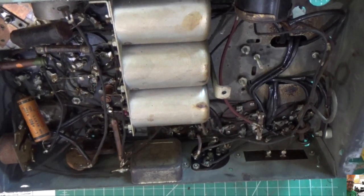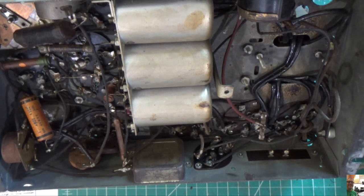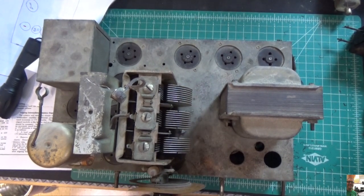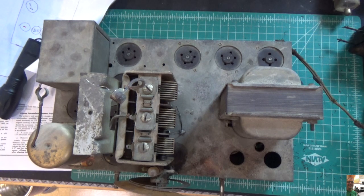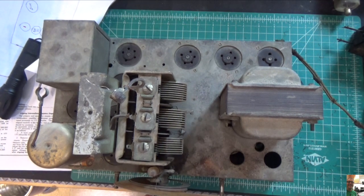I found the other winding back under here — that's the 2.5-volt filament. So the transformer is good. It's amazing what a little WD-40 on a knob can do — the tuning capacitor is freed up, which is really good news. I'm going to be very careful on this radio because it's from 1931. The chassis is probably cadmium plated, and I'm not going to disturb that because cadmium is not good to breathe. I'll do just a mild cleaning and see if I can get some shine back on it.